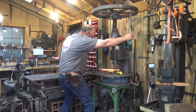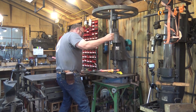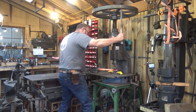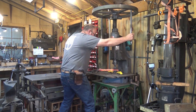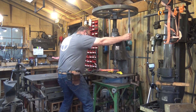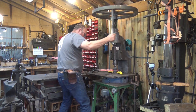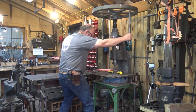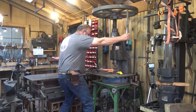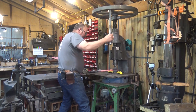I think this definitely has some good potential. I think I need to get the bar a little bit closer before I come to the dies and just use these as a final fitting, which is what I typically do under the power hammer. But if the dies will do this, they'll do that. A little bite, turn it 90 degrees, turn it around, move it in and out.